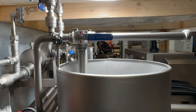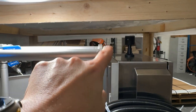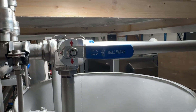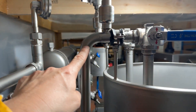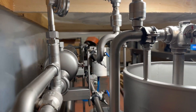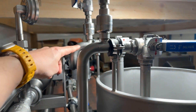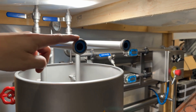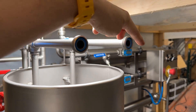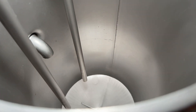When you're conditioning the membranes or doing whatever kind of testing, it goes into here — or you can draw and connect off of here; it's really up to you. If we follow the piping, you'll see that the one on the left is your permeate — whatever permeates through the membranes — and the one on the right is your concentrate. So to repeat: permeate, concentrate. And those two pipes drain into your tank.